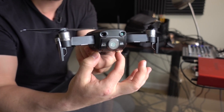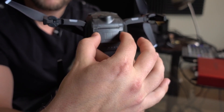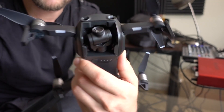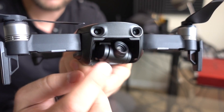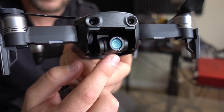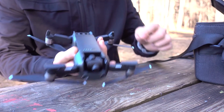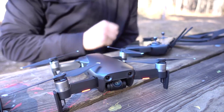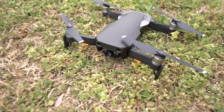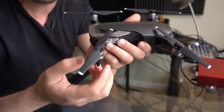Then we can take our gimbal clamp — take our fingers and press these two tabs. That folds up just like that, and then the whole thing slips out forward. Then we see our camera right there. It's fine if it's loose — that's completely normal. It won't actually start being stable and looking like a stabilized camera gimbal until we turn it on. It's important to make sure that gimbal clamp is off when you power on the drone because the gimbal will actually move and calibrate itself when you turn on the drone. When it turns on, you'll also see the props twitch a little bit — that's normal. Make sure the props all look good and spin well, with no noise or odd bearing sounds.